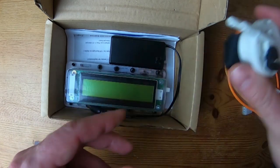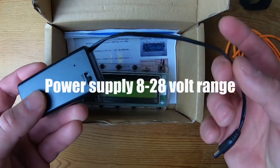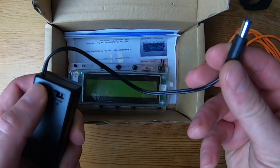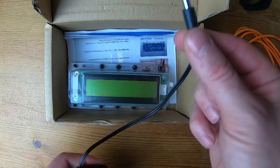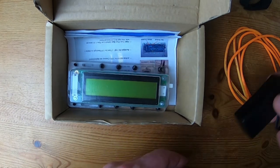It's going to be installed in a specific way so I'll put it to one side for a minute. This is a standard 9-volt battery. The system works between 8 and 28 volts with an on/off switch, and that's a standard 5.5 by 2.1 connector on the end. So if you need to run this remotely or put it away, you could get an extension to run in between that if required.